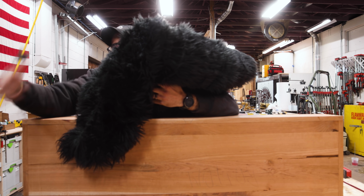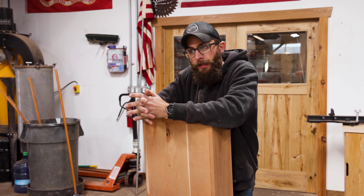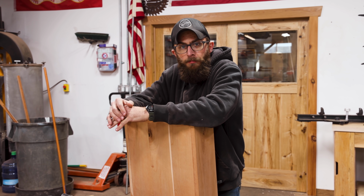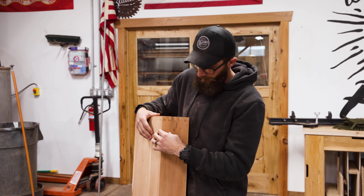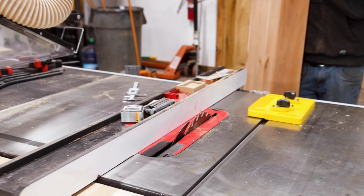Oh my God. Oh, dude. I just swept. Now is the moment that I am the most terrified for. We have to take this box that we've spent many hours crafting and I have to cut it in half. I got this thing figured out. I marked a line all the way around it, so we have a one-third top, two-thirds bottom kind of job. And then we set the table saw with a little feather board so I don't mess this up royally. We're gonna send this.